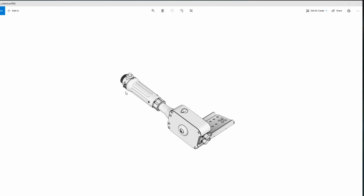So it's kind of a balancing act between having enough clamping force so that the collective doesn't drop or droop, and you're most likely going to get droop when this is at its lower position, because the lower the collective is, the longer the arc is. Well, not the arc, the arc's the same, sorry. The more force will be exerted on it. At a higher, more vertical position, there's less actual force being pushed upon this.